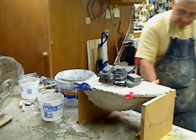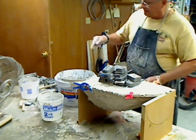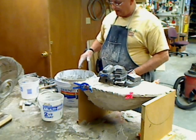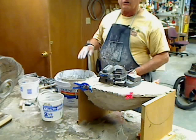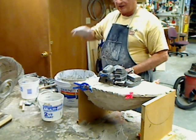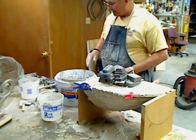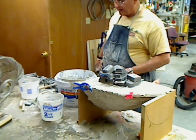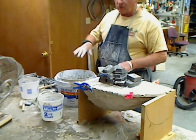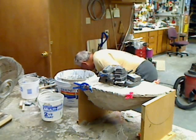Like I mentioned, I can't have one posted on the web, but it reminds me — don't clean your containers in the sink, because this stuff will wash out real nice, but it will cure in the water. It will lay down in your drain pipes in the house and just solidify and clog up your drain over a period of time. Just rinse off your stuff in a pocket of water, let the stuff settle to the bottom, and then in a couple hours you can pour out the water and that stuff will cure and just pop right out of your container.